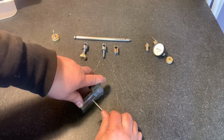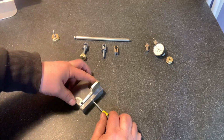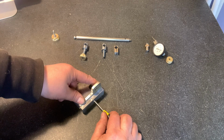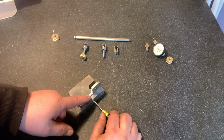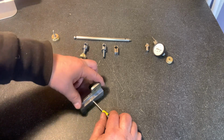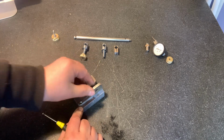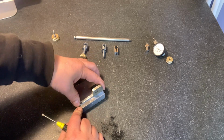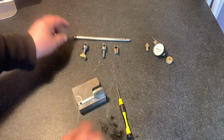Now just a quick reminder, or a tip I guess, when you make that pivot screw, let the threads extend about 1 or 2 thousandths into this. That way it'll tighten this up and it won't flip-flop over when it's time to have the shaft on and all that stuff. So don't tighten things too badly for now.